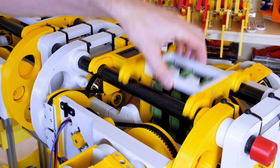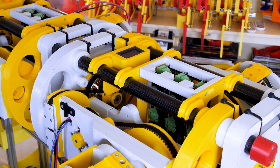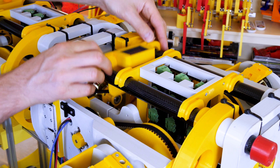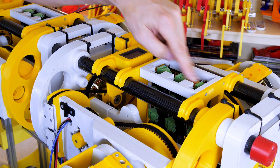That should drop straight in there, which seems to work pretty well, and there's plenty of clearance in the middle. We've also got a voltmeter here, which is just a panel meter and that'll carry two bits of studding for power distribution. The O-Drives are actually capable of reporting the bus voltage, so eventually we'll build a fancy controller that reports it digitally.